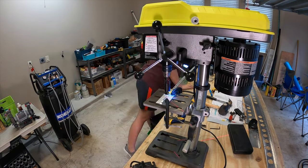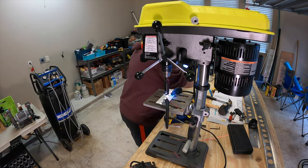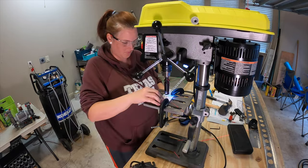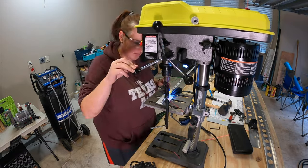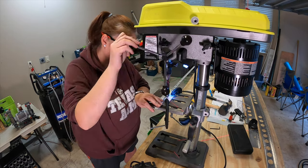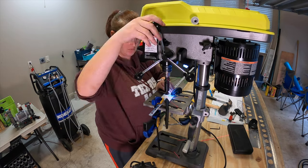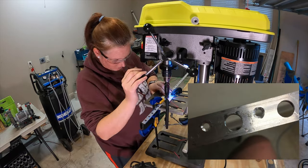The biggest advantage of using the drill press with a countersinking jig is that when you're countersinking these trailing edges, you are countersinking both sides of a very thin piece of aluminum, because it's going to be receiving the dimpled skin from both the top and bottom skins. If you go back to my Day 10 video where I was first countersinking the trailing edge for the rudder just by hand, you can see where I ran into a problem with chatter — once you countersink one side, when you go to countersink the opposite side, the hole ends up getting enlarged slightly.